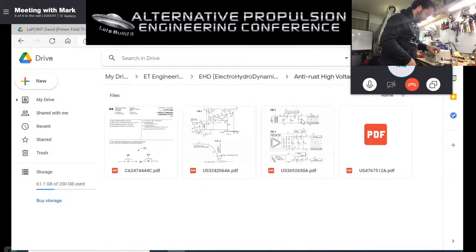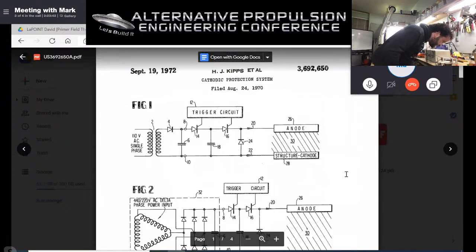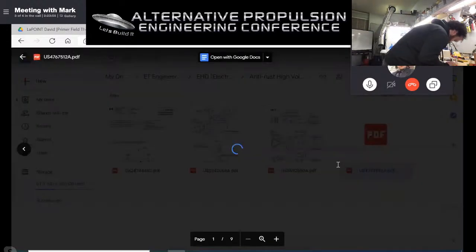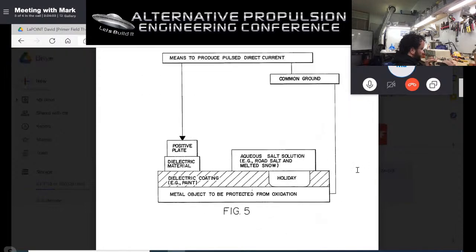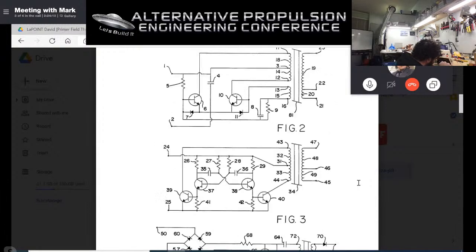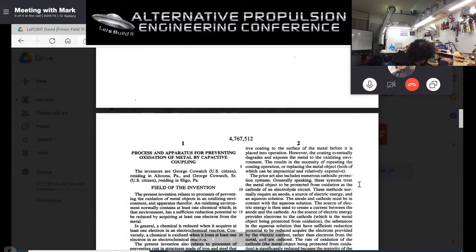Now this should power up just the tubes, hopefully. Yep, you should be able to see them glowing just ever so slightly. So I had this anti-rust thing on here. Where should I expect to see glow? You should see it inside the tube. You'll see those five wires that go from top to bottom. They look like they're just pieces of material to hold it up. Those are actually the filaments that come from the top cap, and they run down past the plate. You'll see them. They glow just a little bit. I mean, they're very, very dim. You got to almost shut off the lights.